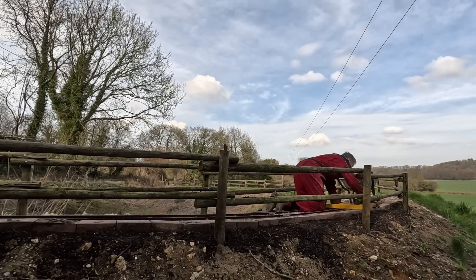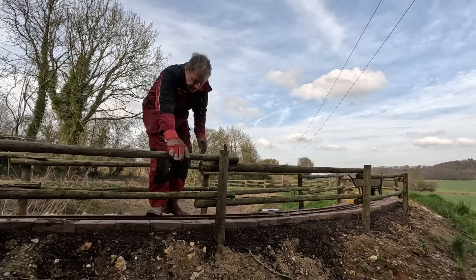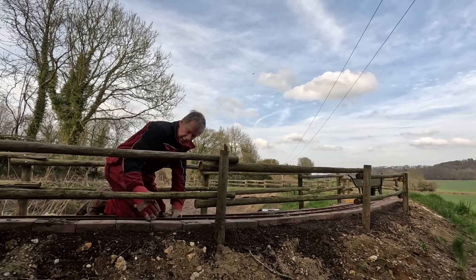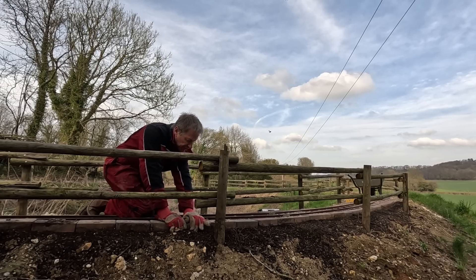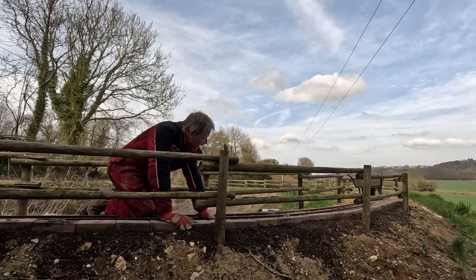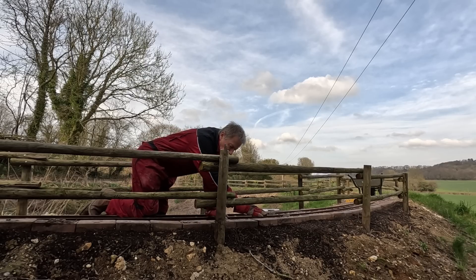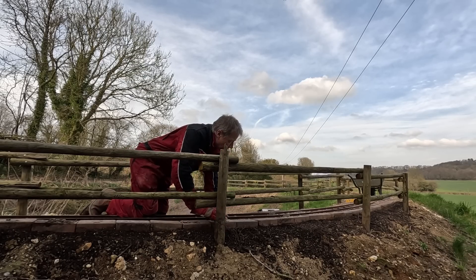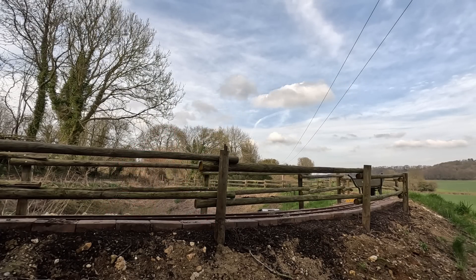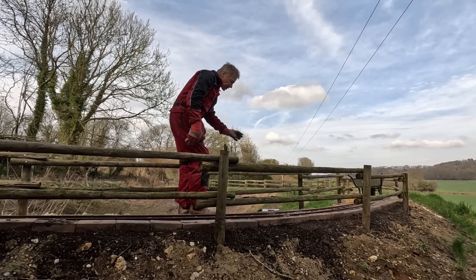I hope you like the high-speed clouds going in different directions at different altitudes. So what we've got now is a line of bricks lifted to about the right height, pulled in towards the track, which means there's less ballast to build up and they're sitting more on top of the embankment rather than trying to fall off the edge. The next thing is to try and lift the track by eye, and then the very last job will be to put some soil on the outside of these bricks to stop them slipping away and make the ballast nice along the track bed. So now I'm going to lift the track up through the ballast a bit — we'll need to bring some more ballast in shortly.